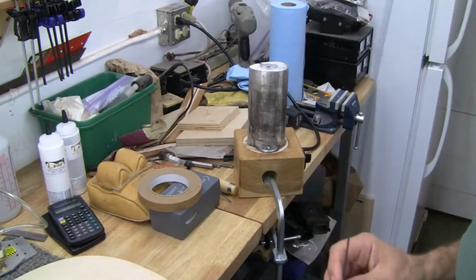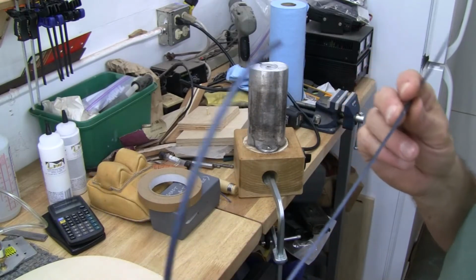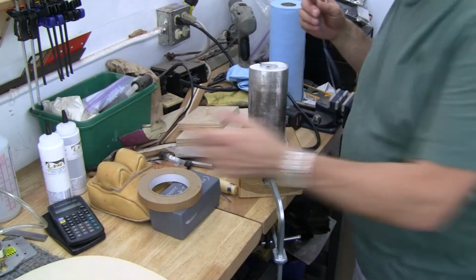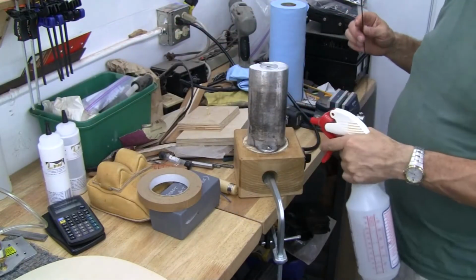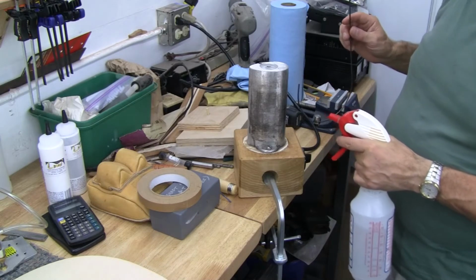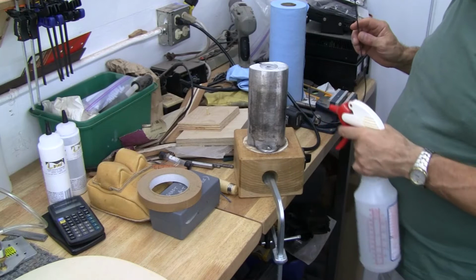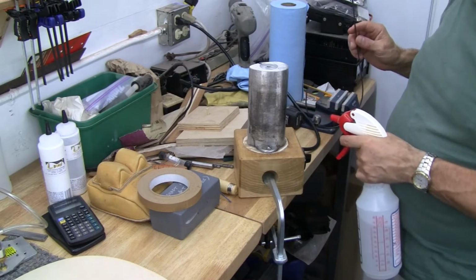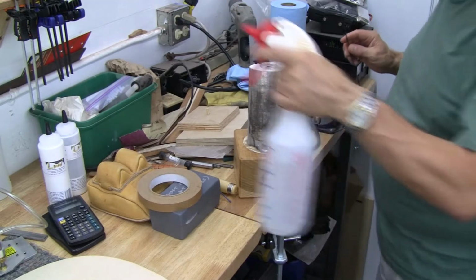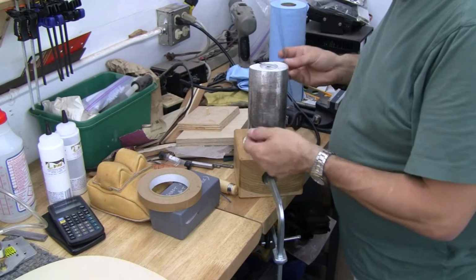We're back, and I've already started bending some of the purfling I made. And this iron is hot. This is one of the Ibex irons that's been hot-rodded by Howard Klepper, I think his name was, who found a hotter element and a different controller. It should spit back at you when you spray water at it. And this one is pretty hot.